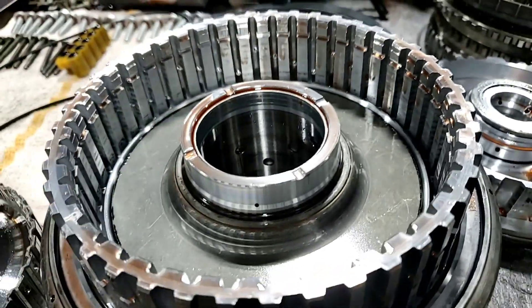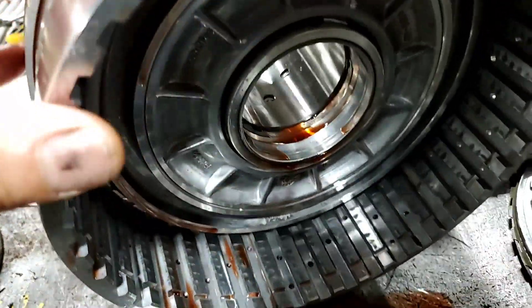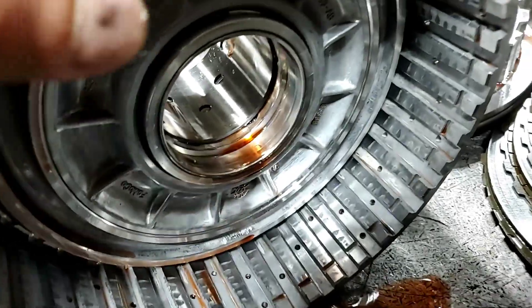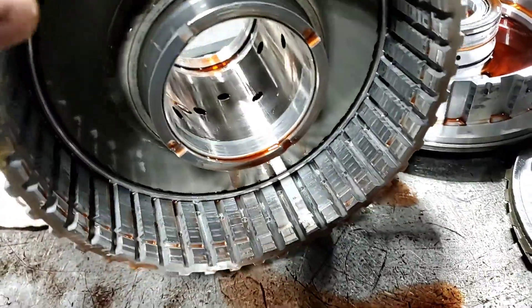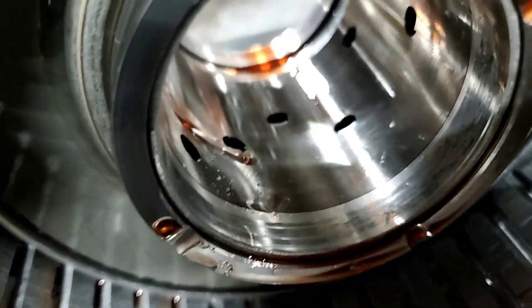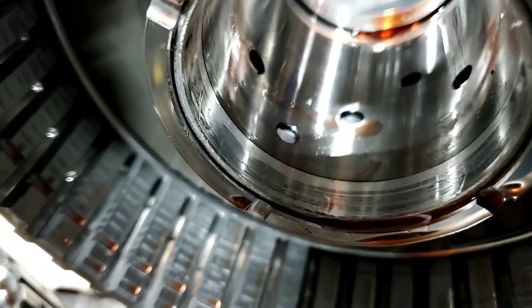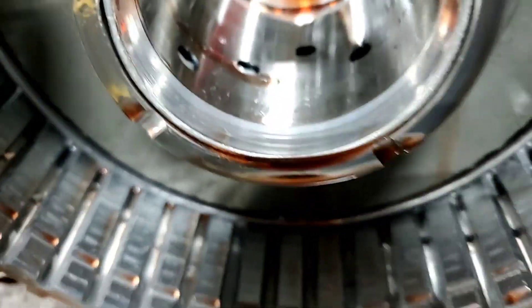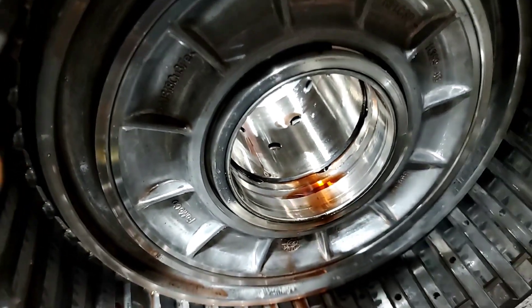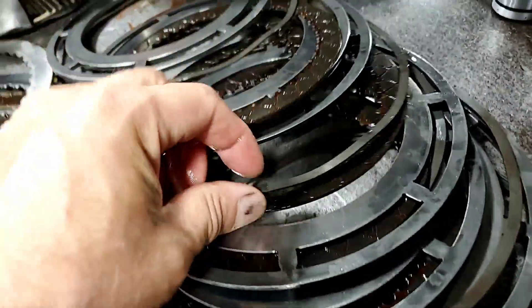Their normal operating temperature is a little bit higher than normal, as I'm going to show you right now. You can see this bushing is worn out, and you can see the holes through the sleeve where the sleeve moved. If I turn it this way, you see the holes and you see half moons in there. The camera phone may not pick it up that well, but you can see the half moons — so the sleeve moved this way, and that's what was causing it.